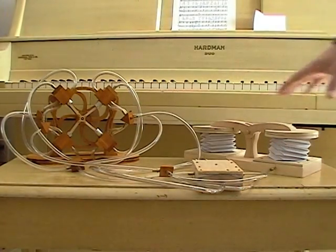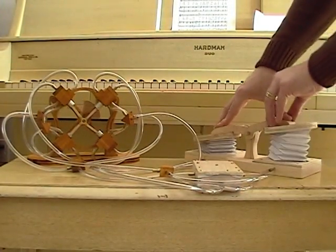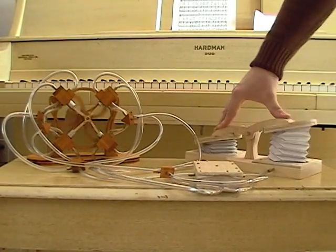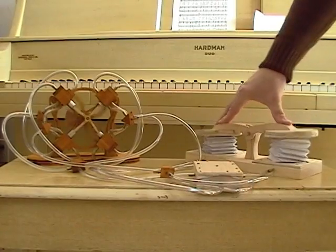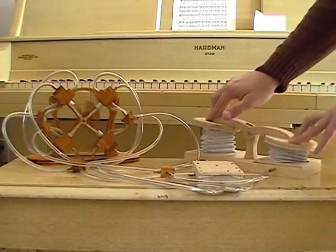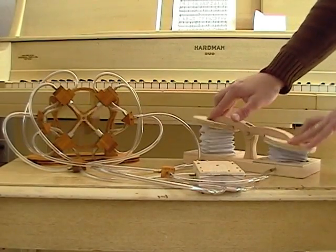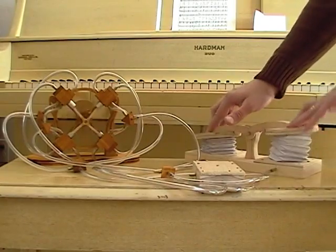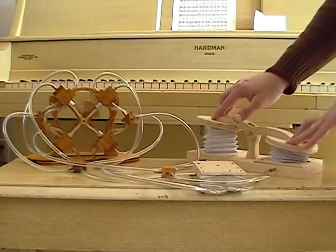The engine could have any configuration, as long as there are an even number of pistons. I plan on building a V4 version when I get some spare time. With the power system, as with most things, I would need to build and design it a couple of times to work out the minor issues. For instance, I should have made the joint for the bellows on the side instead of the corner. This has proved difficult to seal, and only one of the bellows is actually working effectively.